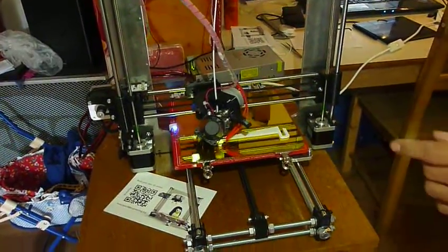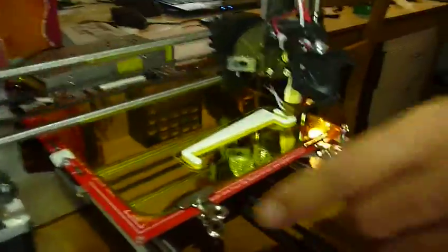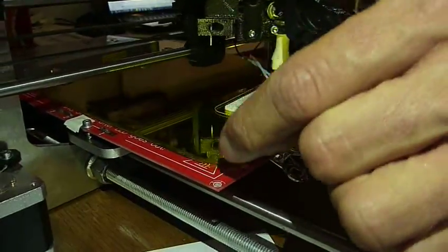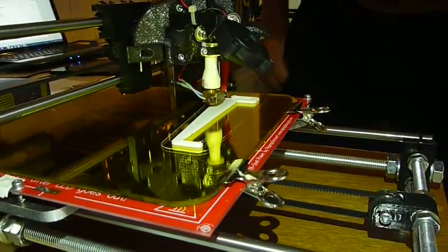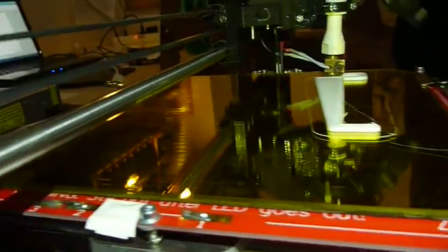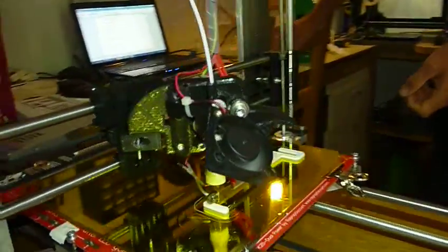Talking about the plate — a small detail we'd like to add is a small screw so that when we start printing, the nozzle can park there and doesn't ooze so much while warming up. We also want to integrate some small knobs so you don't need a screwdriver to level the bed. That might be very nice.